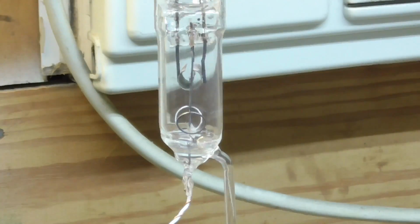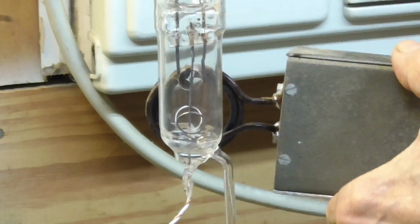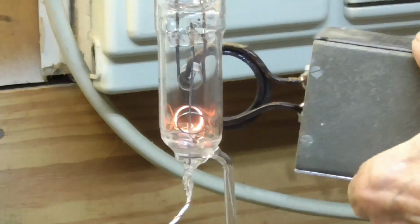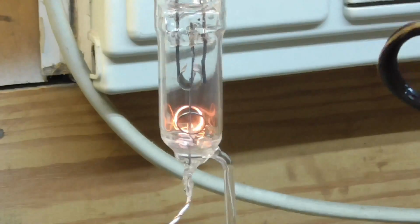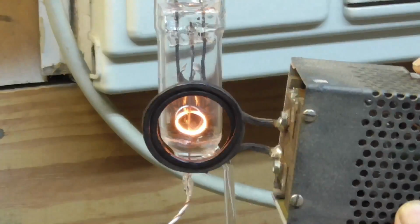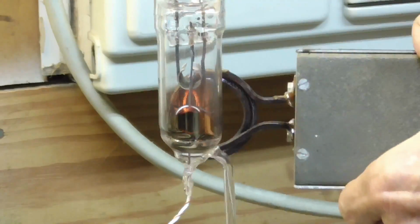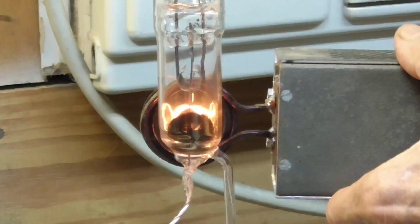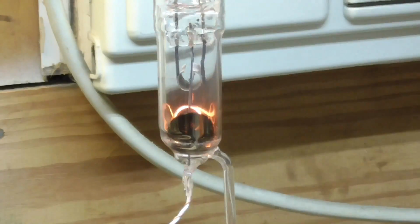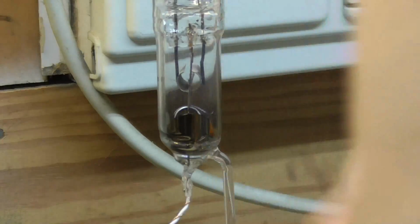Give it a few seconds. Doesn't take it long to pump the gas out. Okay, here goes. We'll flash the back one first. Whew, not getting any flash. They're bad getters. A little out of that one. Now we'll seal her off.